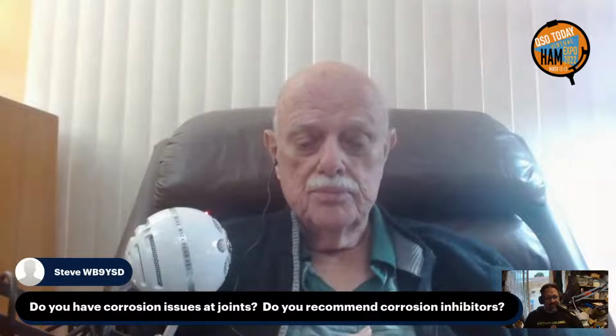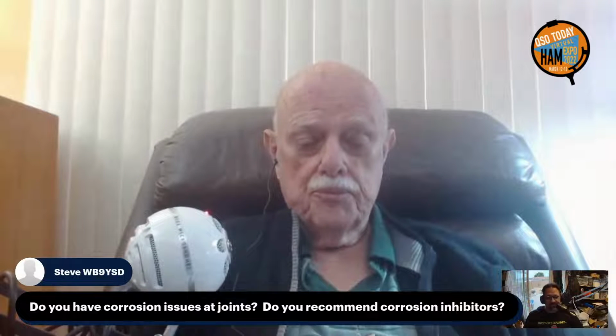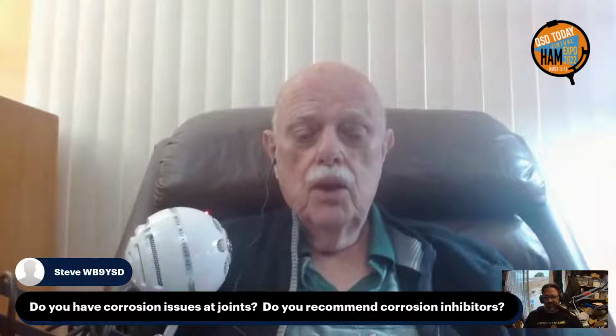Steve, WB9YSD asks, do you have any corrosion issues at those joints? And if so, do you recommend any corrosion inhibitors? Well, I don't have any practical user information about it. But Noalox, the material that's often used for connecting aluminum joints together in beam antennas, might be a good idea at the joints. I wouldn't think that would be a bad idea at all because the joints connect mostly by capacitive coupling anyway. They don't connect too much by pure resistive coupling. So putting some Noalox on there, which has a conductive material in it, would be a good idea.